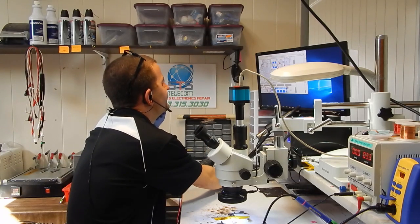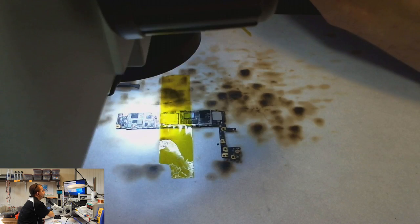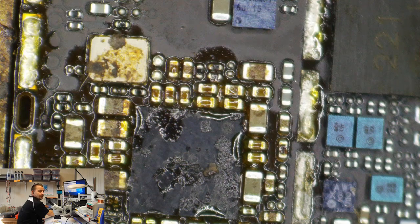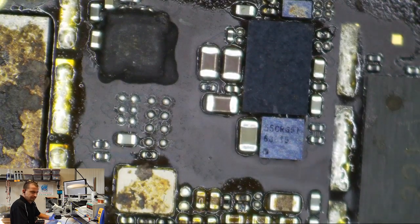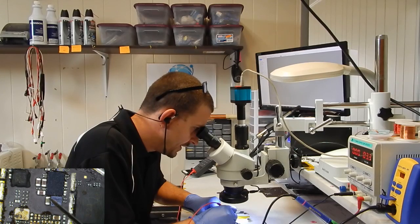So we are going to use C1417. I'm going to hook onto VCC main here at C1417. There we go. VCC main comes off the top of that and goes under that IC. So we are going to hook up VCC main there and I'm hunting for heat.